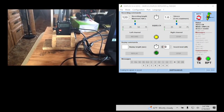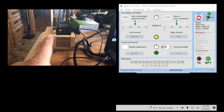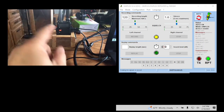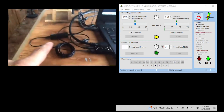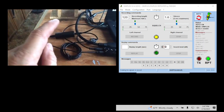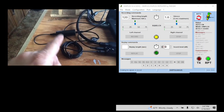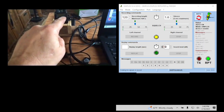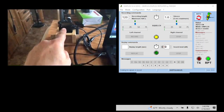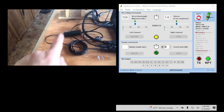Once you have your handheld, you're going to need cables — I'll post a link to all this in the description below. This particular handheld uses a 3.5 millimeter plug and a 2.5 millimeter plug. You're also going to need a ground loop isolator block — I'll post a link to that too. If you don't use that and you plug the cables into the computer directly, it's going to key up the radio and it will stay keyed up forever, like you're pushing the transmit button. So you need the ground loop isolator block.